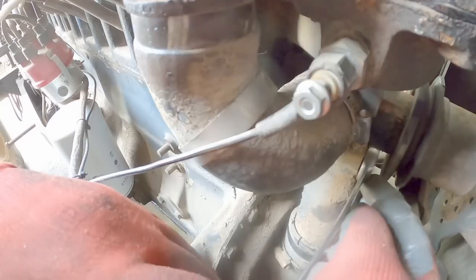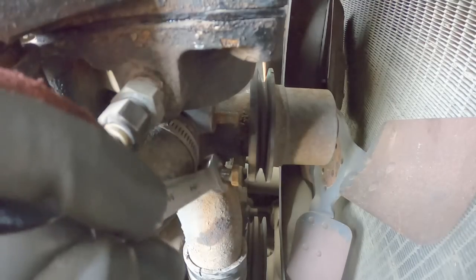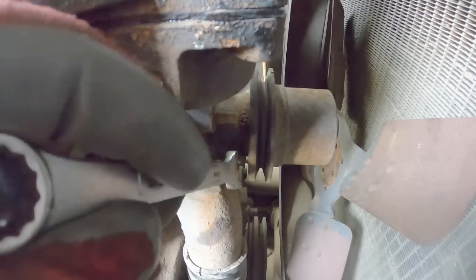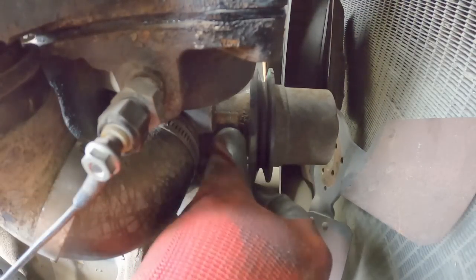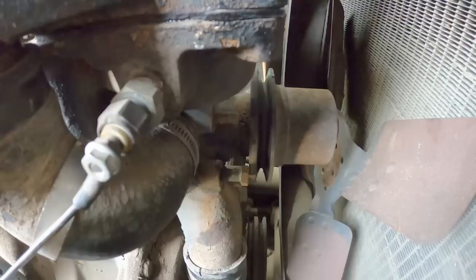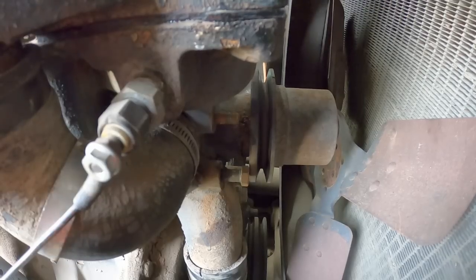I think I'm gonna go ahead and put new antifreeze in it. The stuff that's in there looks kinda dirty. Somehow or another, these water pump bolts always get a little coolant in them and a little crusty and don't like to turn. Okay, that's the one that doesn't come out because of the pulley, but it should be out enough now. I think I can get the other 3 from the other side.